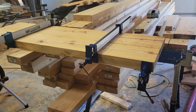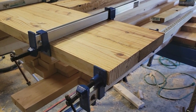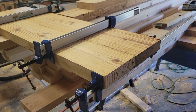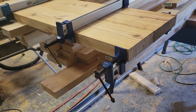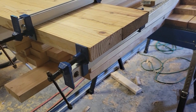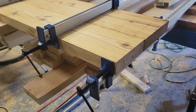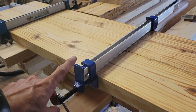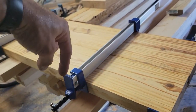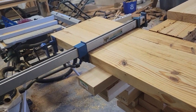Now we're clamping up the top. I kind of just got heads-down and did work, but I put the dowels in and I planed and fit the edges. I like to alternate the clamps — it seems kind of weird to do, but I feel like they do a better job. Sometimes they clamp more on the side that the bar is on and less on the other side, especially since I have Harbor Freight clamps. So I alternate them so if this one is pulling it one way, this one will hopefully offset that by pulling the other direction.